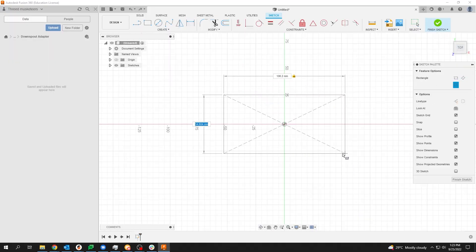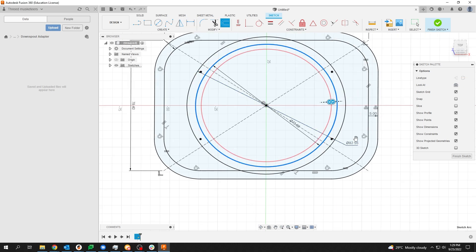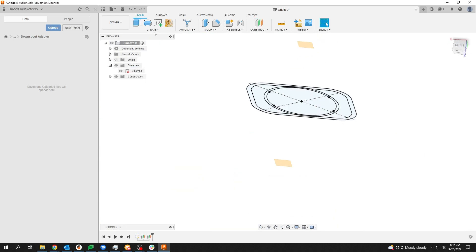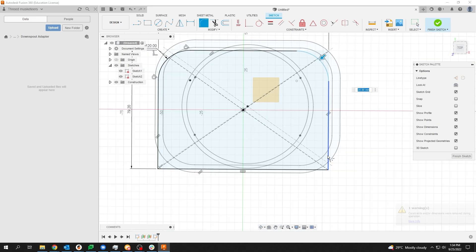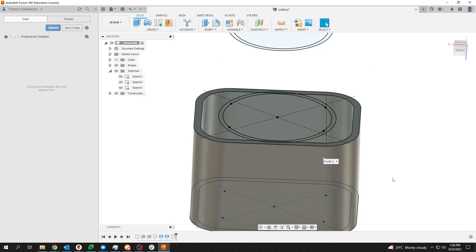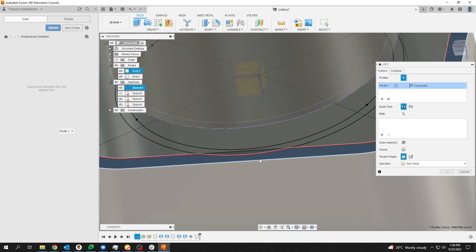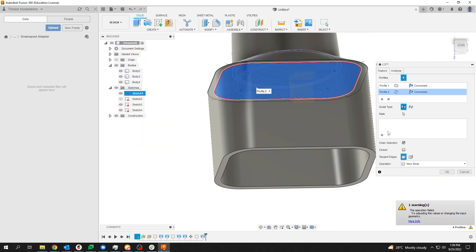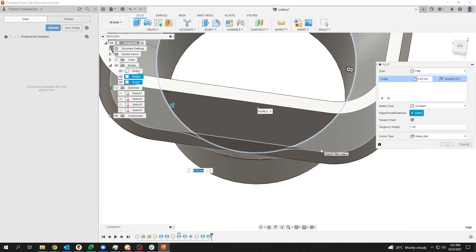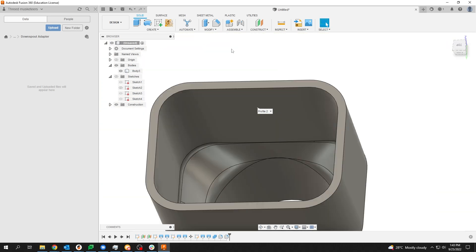Building this was actually not all that complicated. Ultimately, it required getting a couple of measurements and making sure that we added the correct tapers. We're tapering only about two to three millimeters on each piece. That should give us enough to get from a snug fit to something where we can easily screw in to the downspout as well as use a hose clamp to put on the actual part itself. This 3D print — I didn't want it to take very long, and ultimately five millimeters was way too thick. We went to a three millimeter wall all the way around, printed in PETG, fat layers, fat line widths, just to make this thing print quickly and be as strong as possible. Held with a couple of tech screws, and of course, link to the file down below on Prusa printers.